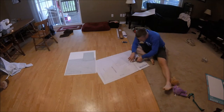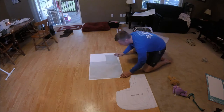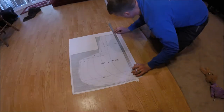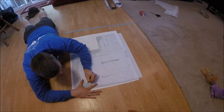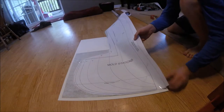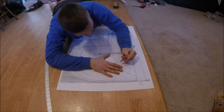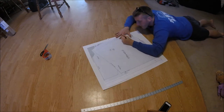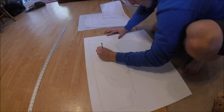For this phase of the project, I began by taking my plans, which I purchased from Bear Mountain Boats, and just cutting them out. I used some carbon paper to trace each mold station onto some really thick stock poster board that I purchased at Walmart. It's just a couple extra bucks, but it allows me to have an extra set of plans just in case I make some monster mistake and ruin the whole set. I used a straight edge ruler to mark all the straight lines on the mold stations, and then very carefully free-handed the curves. I removed the template, got a new poster board, and repeated the process from mold zero all the way down to mold six, including the stems.